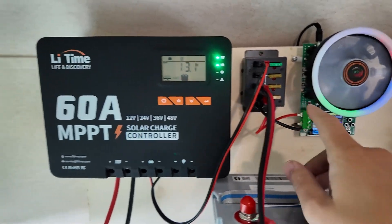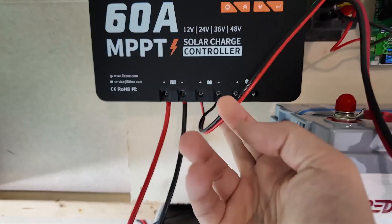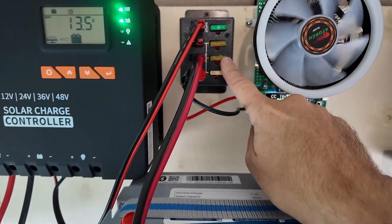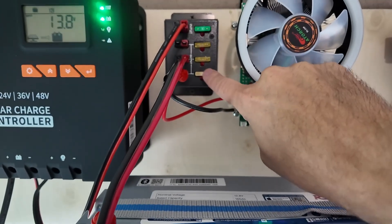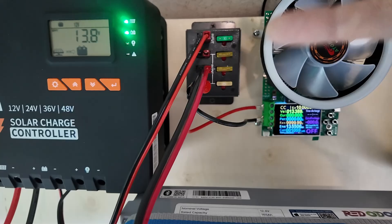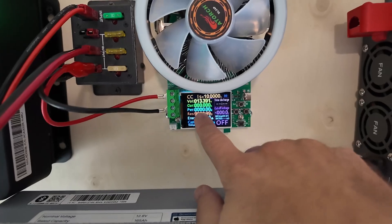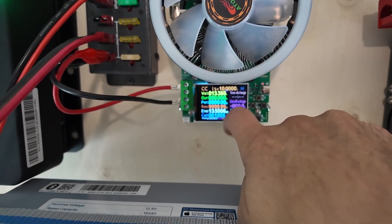This thing has a cumulative recorder of the power drawn from the battery. So I'm going to recable this in, get my solar panels hooked up, and show you one of the things I think is really neat about why this tester is actually cool. So this is why I have the Anderson PowerPole block on here. I have connected the solar charger into the top one — that's got a 30 amp fuse. The battery comes into the next one down — that's a 20 amp fuse. And the load tester is on a 25 amp fuse. We are reading 13.8 volts on the battery, and over here we're reading 13.38 to 13.39.